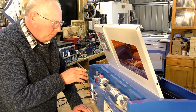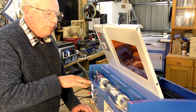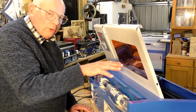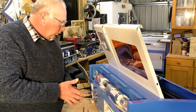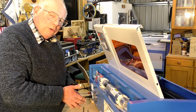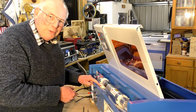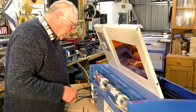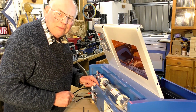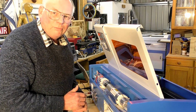In finding out this problem, I've actually just solved a mystery. In the first video I made with this, the unboxing and cleaning out, I found in the bottom, just lying around, two little, I think it's 7mm nuts. Well, I just found out where they came off, because there's nothing on the bottom of these screws. So I've just put them back on. And now I should be able to move this 2mm like that. I just did it. So yeah, that's something to look out for, isn't it?